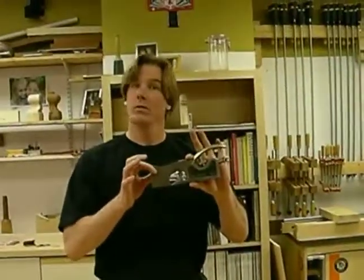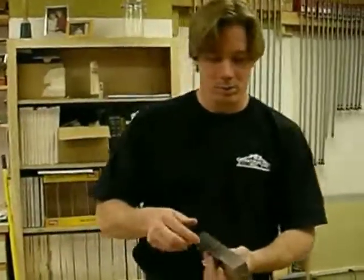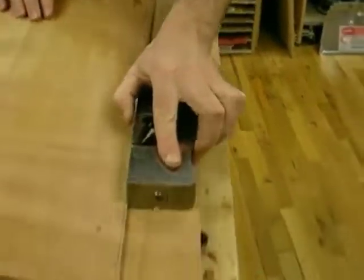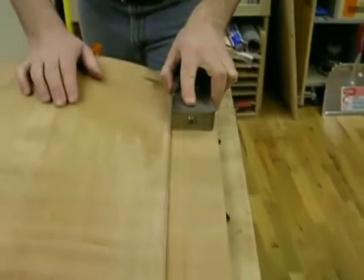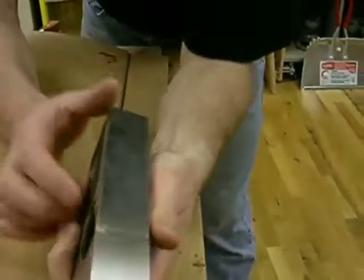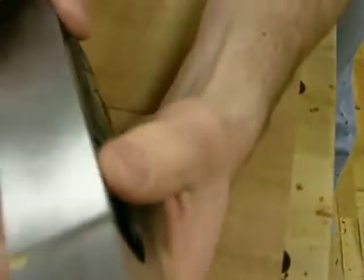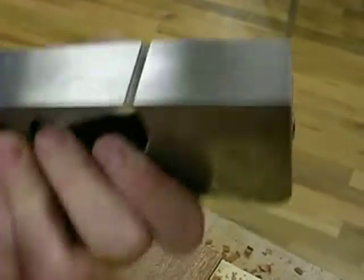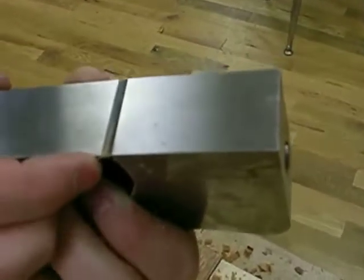The next important part of this shaping deal is that I have to get this reference line on the bottom out. And this is a shoulder plane — that's right, buddy, shoulder plane. Here's a little trick on this shoulder plane: I have to plane flat, coming this way. See? You see how this blade can move left or right a little bit? It's very important not to have this blade beyond the shoulder, because if I start digging in here, I'm gonna destroy the bottom of the piece of work.